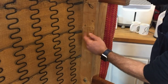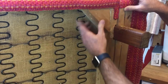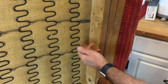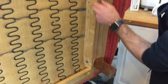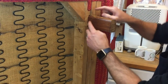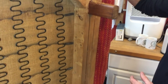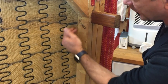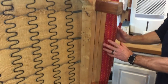Unfortunately, when they were shipping it to their new home in the United States, this arm was busted. They had it repaired when they got here — the person did a great job, put a corner block in and added dowels. However, they don't have the bolts anymore in this corner block. Grant and I would like to drill out the dowels they put in, then get it back together nice and sturdy, but we have to save the fabric for the client.